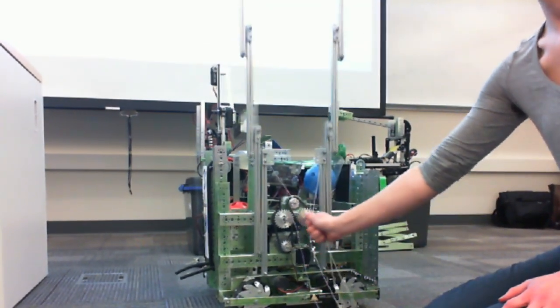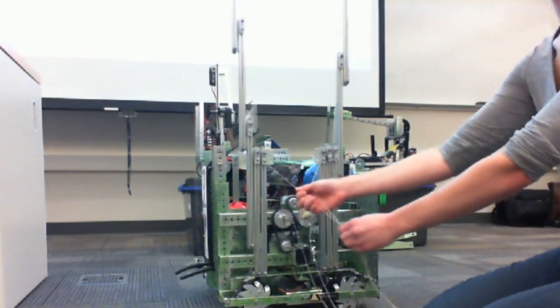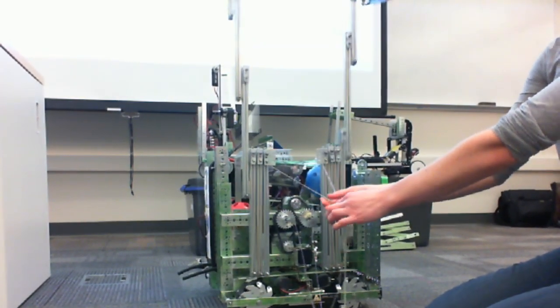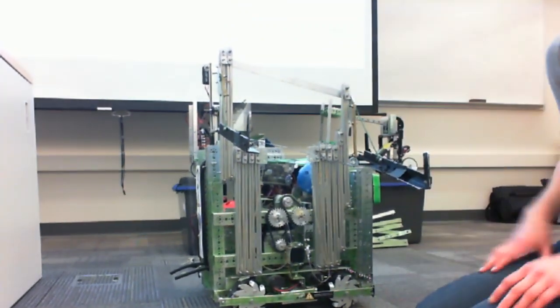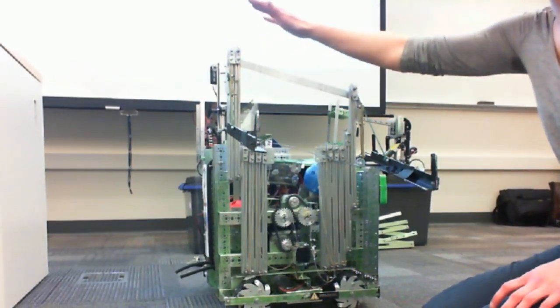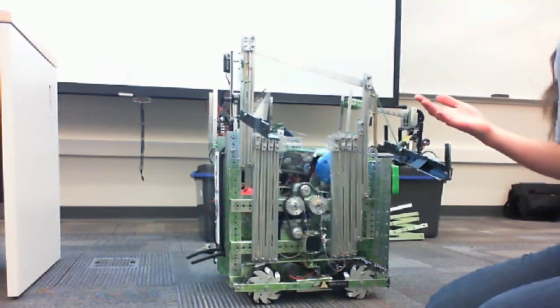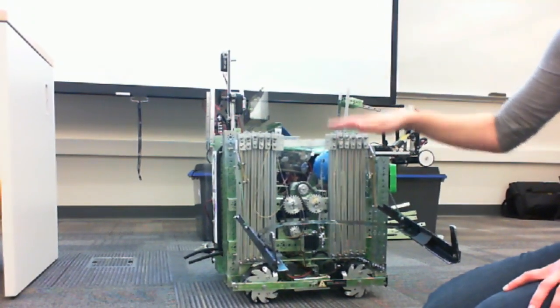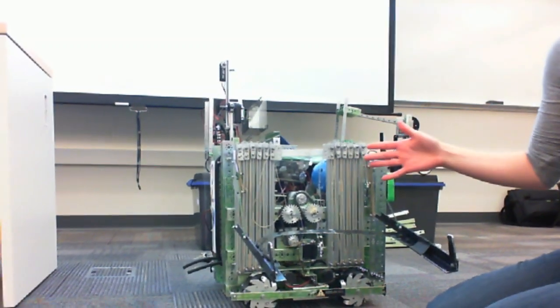One thing I noticed with this one is to think about when coming back down. This one has almost no weight on it coming back down, and it does mean that if I just drop it, it tends to get stuck at some point, and we have to restring the whole thing. And if something just forces it down, or if the motors were to keep releasing string, all the string comes off the pulleys. No lifting mechanism is without maintenance, but I would say any lifting mechanism with string on it just skyrockets the maintenance.